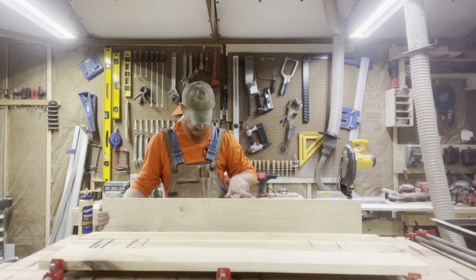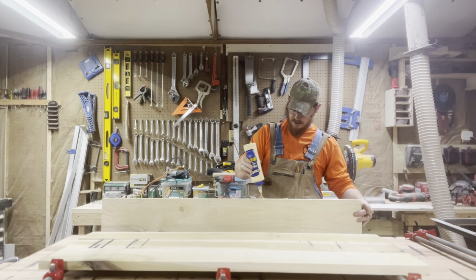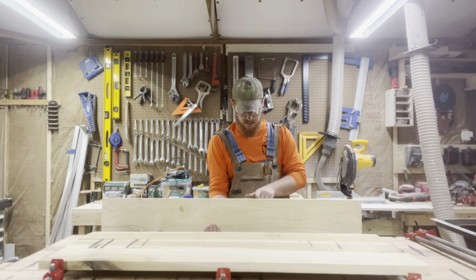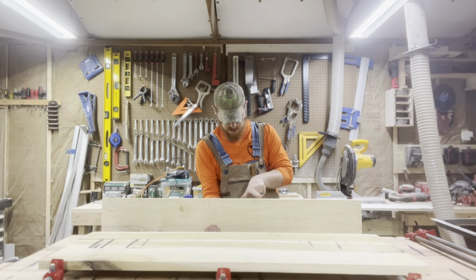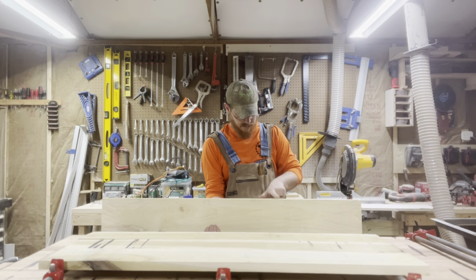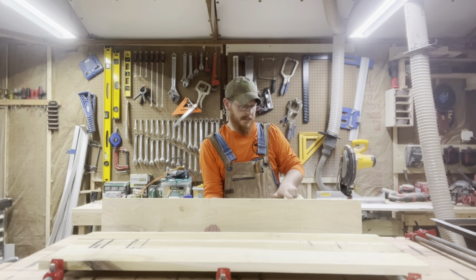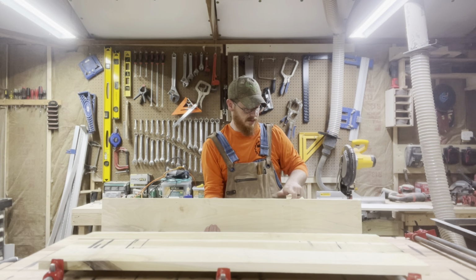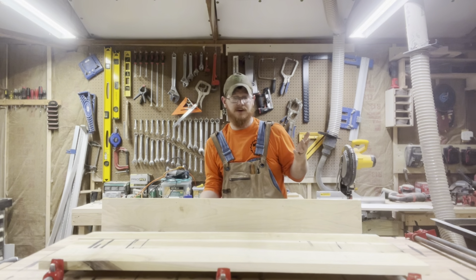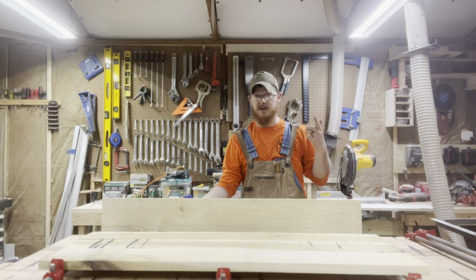All this is, if you ever do this, is I'm making a panel. That's it. That's really it. I didn't even run them through the joiner real great. You can still see some rough cuts right there, but just run through the joiner, joint one edge, glue them, as long as your planer will fit. I'm doing these, and this will be two different glue-ups because they won't fit through my planer.